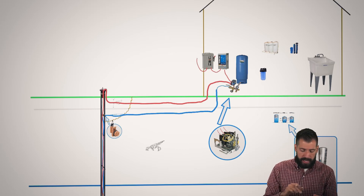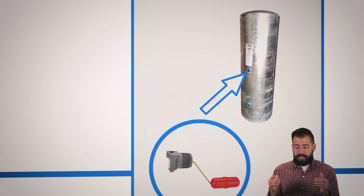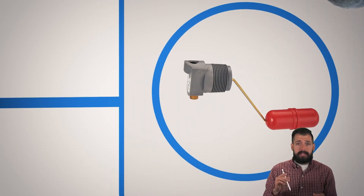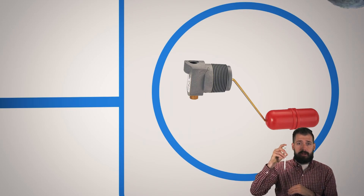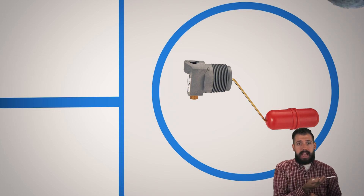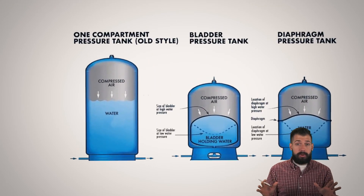On this first style here, a more traditional style, this is normally what it would look like, with everything kind of all combined together. You'll normally see it in this type of a storage container. We have this device here, and again, whenever the bobber goes up, it is closing off that system. Then as soon as you are done with all your pressure, it releases, and that allows the water to flow back down. That way we don't have any freezing issues. That is the older style, and that's still a very appropriate way of doing things.